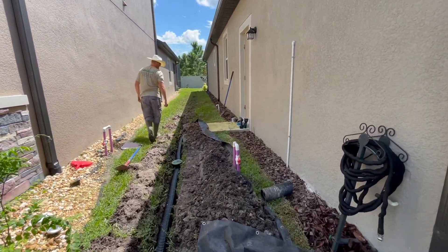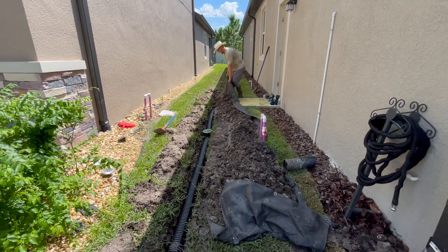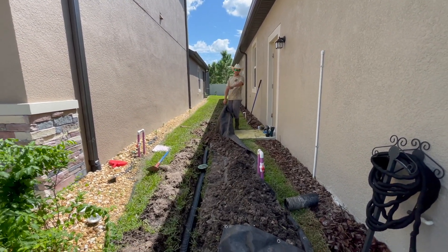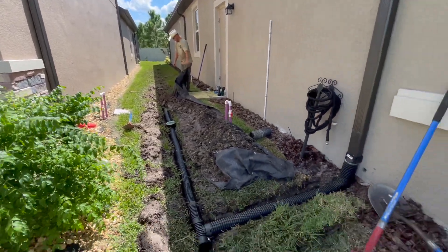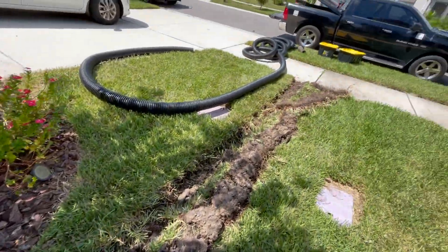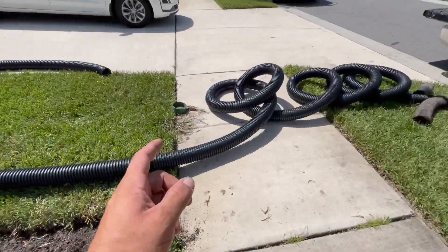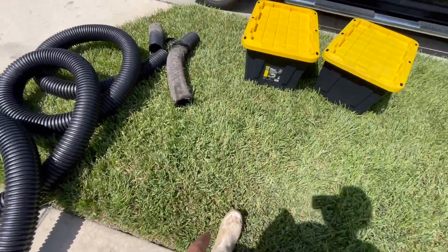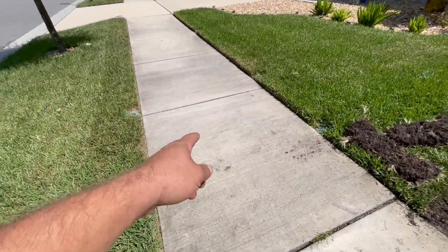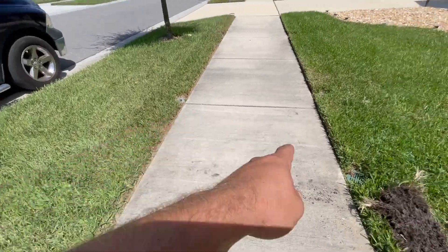We're about halfway on this side. Joe's putting the dirt back on, backfilling right now. We ran into a ton of clay so we had to break out the rotary hammer — that's what happens here in the Epperson area in Wesley Chapel. Got this downspout connected here, teed in, and now we've got real good slope coming to the front yard. Sod's all removed, just got to trench out a little bit. If we can, we're going to go under the sidewalk. If not, we're going to put an emitter here with a catch basin so they don't have a ton of water buildup and mildew growing along here. You can see how it's darker around here and lighter where the driveway is — that's because water stands in between these sidewalks.